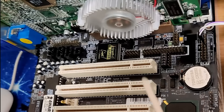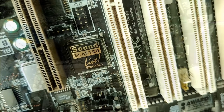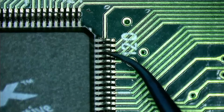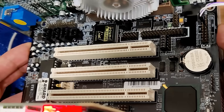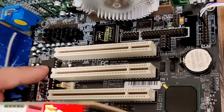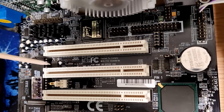There is something else I found out while looking for an explanation. So what is going on here? Is there a leg of the audio chip disconnected? We have seen loose solder joints on many Voodoo cards, and this board isn't much younger. While looking around and pressing on different components on the board, I scared myself when pressing on the BIOS chip — that pop came from my speakers. Something near the BIOS chip seems to be causing this. So I explored the surrounding area and a few seconds later, I found the offender.